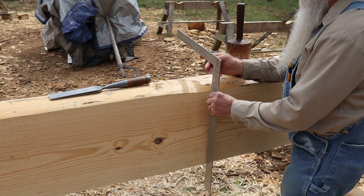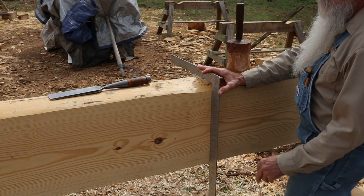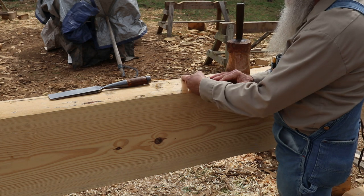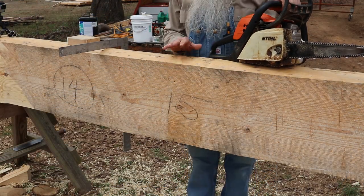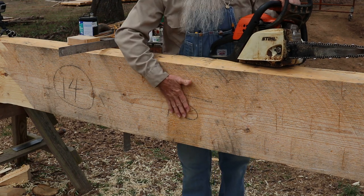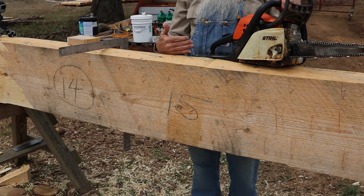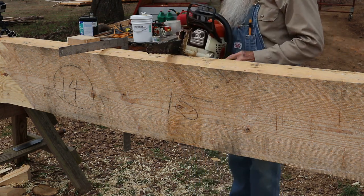Across here needs to be square with the inside face of the log. And so I'm just going to take my chainsaw and start brushing this lightly back and forth. There's one more thing that I want to add to that. You can see the outside surface has not been hewed. I like to stand on the inside face of the log when I do that,